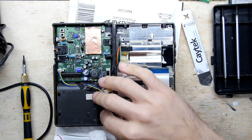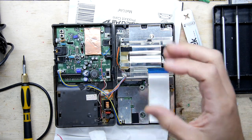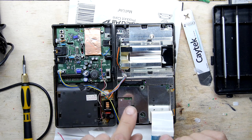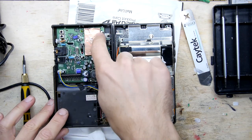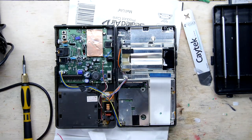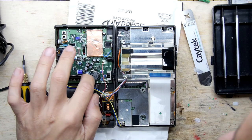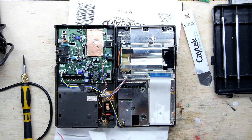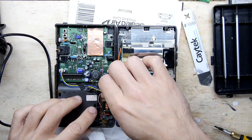You've got your cold cathode tubes here — I keep saying fluorescent tubes but they are cold cathode tubes. There's a power supply here that looks like a high-tension driver — not a million volts but significant voltage to drive and energize those tubes. Your tuner technology is under here, going straight to the panel. Then you've got your demodulator stage, your screen driver, and your tuner. There are a few slightly bulging-looking caps there, so those could be causing some mischief.